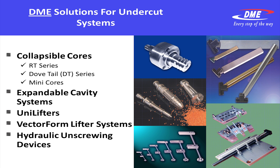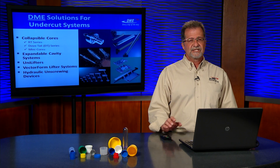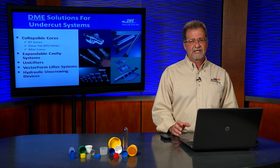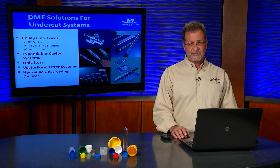One of the solutions that we've had for over 45 years now, with tens of thousands of applications in the field worldwide — some of the tooling as large as 96 cavities — are collapsible cores, or what we now call the RT series. Fourteen different sizes, ranging from around five-eighths diameter up to over four inches in diameter. These have a 12-segment design developed back in 1968, and it is still the same design today. We know that it can run millions of cycles, upwards of five million before you see appreciable wear.